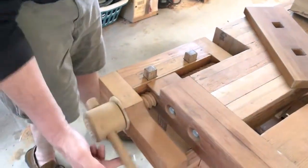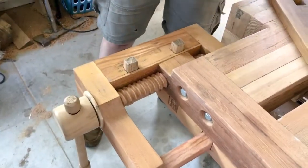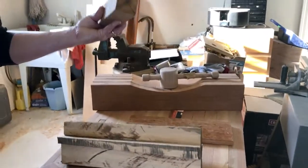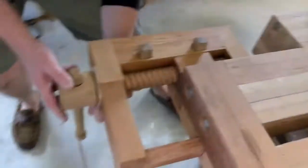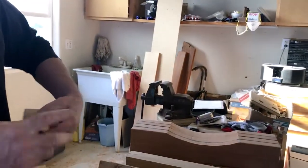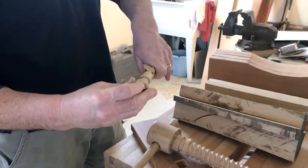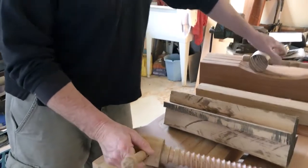You can see that I made this screw myself. I made it out of eucalyptus — a piece out of my firewood pile. I basically cut the blank out, milled it down on my lathe, and made the screw with that. I cut a hub and I've got the handle with knobs on it, which I cut a slit in, push the knob on with some glue, then drive a wedge in the end.